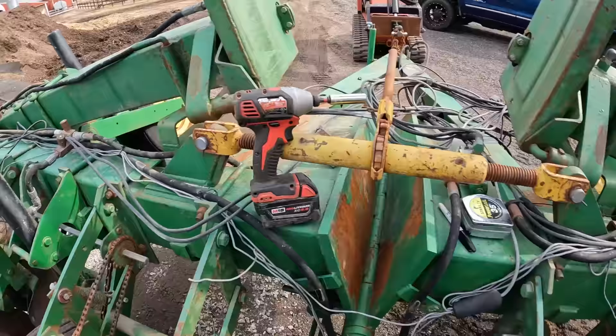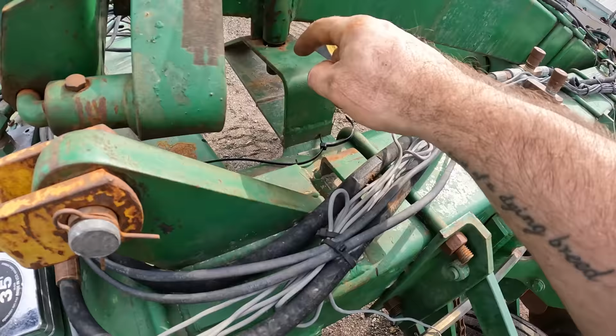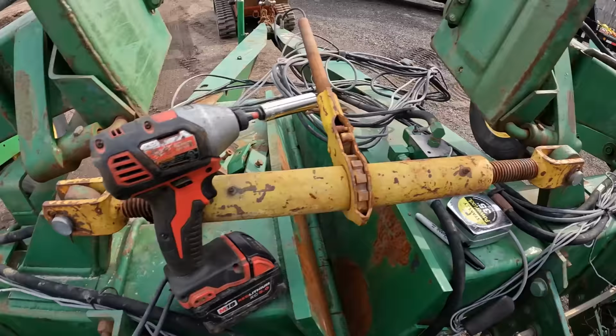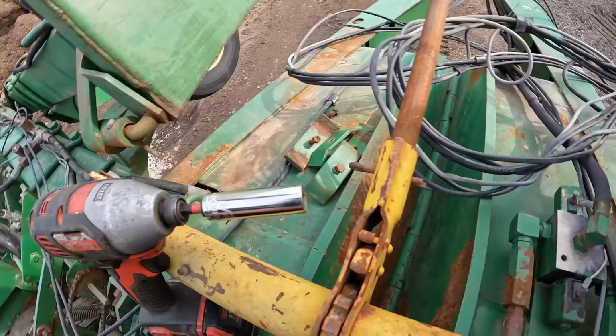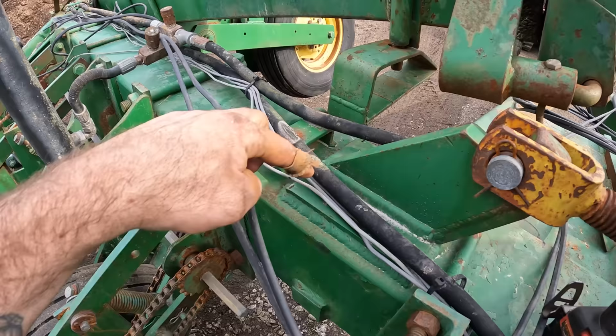So we'll move some things around. I marked it already. We got to move this one. This is outside of this U-bolt. This is outside. So as you see, on this one, we're just gonna have to cut that off and move that bracket, which also means we're gonna have to move that when we're done. This side, oh, and along with cut underneath this bracket to the U-bolt. Same with over here, we cut that. We're gonna have to notch the flex lock in the middle, which there's plenty of weld there anyways, so we'll have to cut that out, cut it across, and then re-weld it just to the right, but that will miss. We won't have to cut this off.